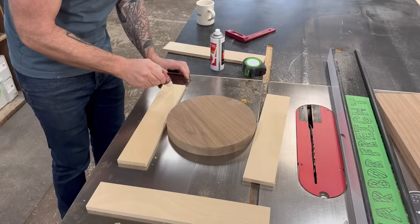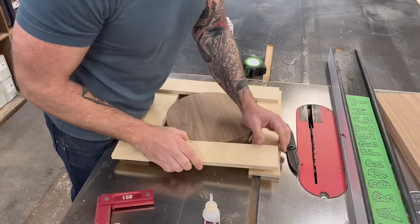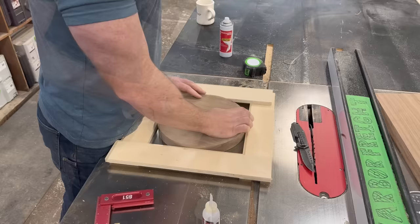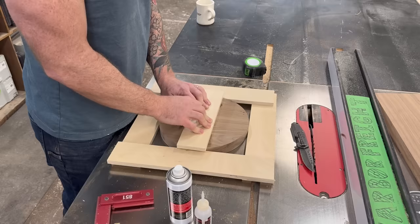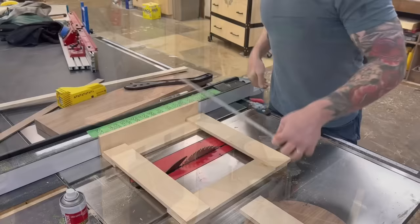It still looked plain, and I was thinking about whether I could add a cove to the entire top of the seat to give it more depth and make it look more inviting. That's when I had this weird idea: you can cut coves on the table saw by running a long straight piece of wood across the blade at an angle — so why wouldn't you be able to cut a cove on a round piece of wood? I started out by gluing up a square of scrap birch plywood just tight enough to hold my walnut round in place but still let it spin freely. Then I super-glued another piece of scrap plywood onto the back as a handle.